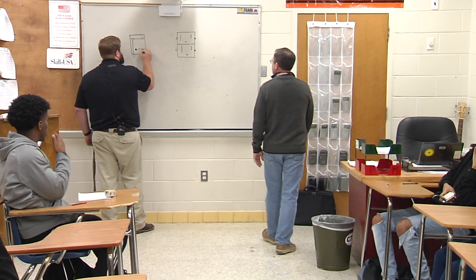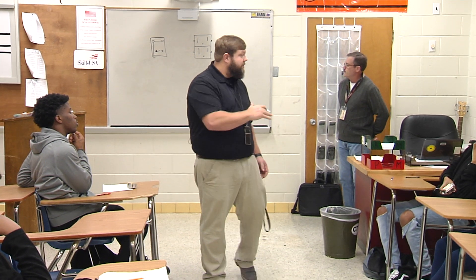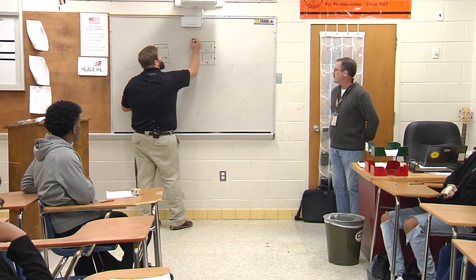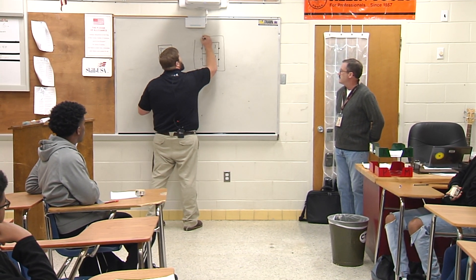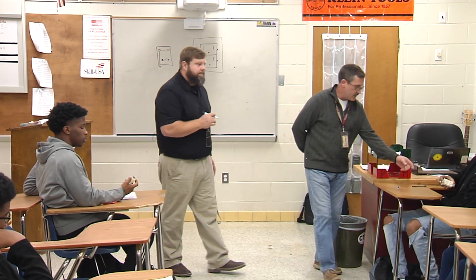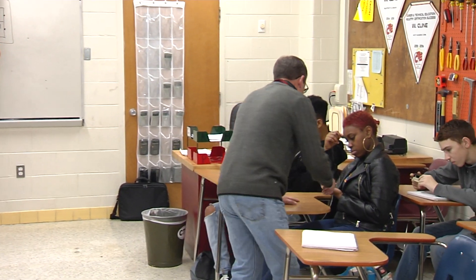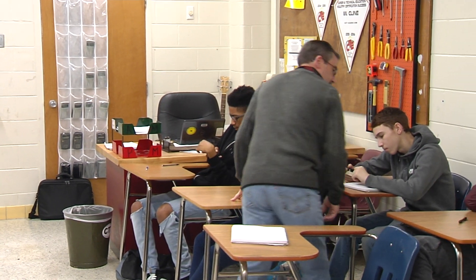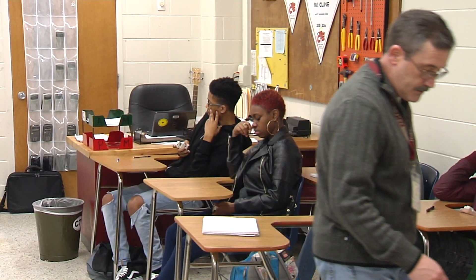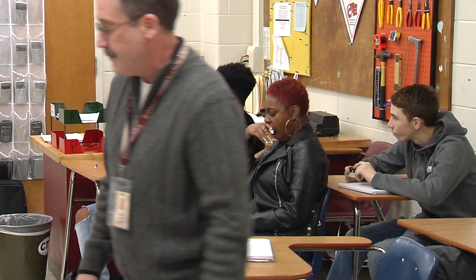What I want you guys to do in a few minutes is go out to the lab and perfect wiring this. We're going to teach you how to wire it first and then you're going to work off of this drawing. The first thing I've drawn is the panel box and I'm going to draw my GFCI. This still has a box that it goes into — the GFCI looks more square. On the back of that GFCI there are a couple things written on it. Line and load. Line is usually on the bottom, but always double-check because some manufacturers put it at the top. Always write line and load so I can see what you're doing.